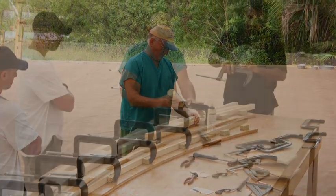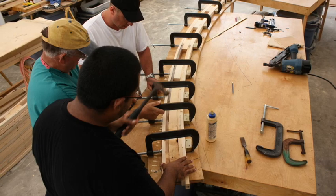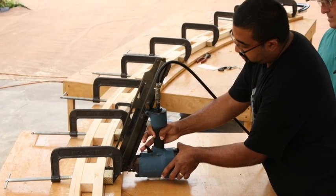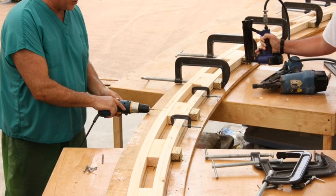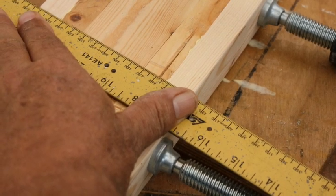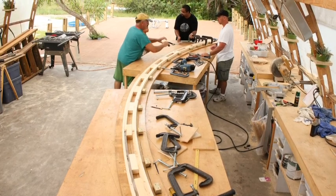There I'm gluing up one of those 30-inch pieces. After all the clamps are in place — you just kind of take your time and fix any bad spots as you go along — we used an inch-and-a-half staple gun and stapled all of the 1-by-2s together. Wherever the 2-by-8 blocks are we used ring-shanked 16-penny nails and nailed those in really well. We put in screws anywhere there was an external joint, which in these is only in the center. After all the fasteners were done I transferred the lines on the top and bottom cuts from my jig onto the finished arch, then removed the clamps and slid the finished arch down and cut it with a skill saw so all of our cuts were completed.